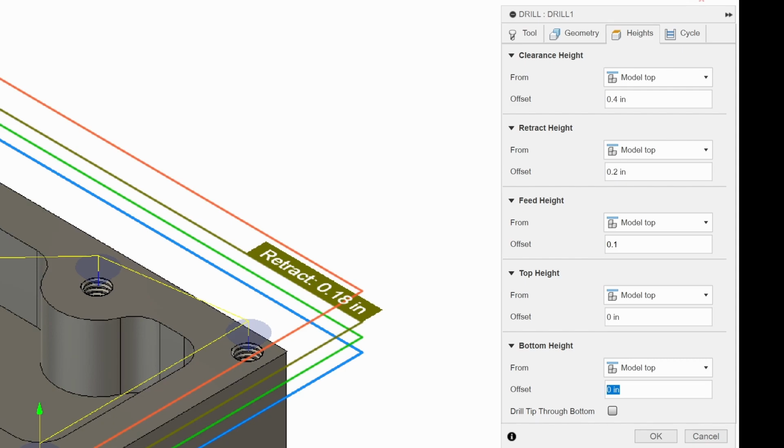So the depth of our hole for this doesn't have to be very deep, just deep enough to make that center punch for all intents and purposes. But we also want to use our brains, speed things up, and what we can do is we can also drill a little bit deeper than needed and put a chamfer that the finished hole will use to break its edge and not be sharp. Now we're using 10/32 thread, so there's some math involved, but let's just say that if we were to drill to a depth of negative 0.105, it will spot and it will chamfer the hole.